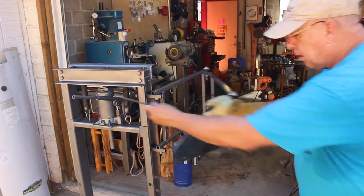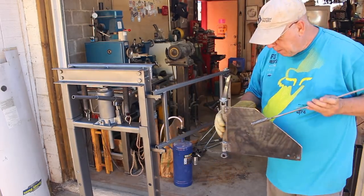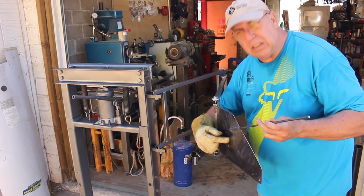Here's my torch holding device and I've got my stylus that will be bent into the appropriate place once I get the pattern holder installed and the torch head bolted on. We've got a good range of motion going on here — it's a little stiff here and there but I think it'll wear in, and I'll put some lube on it. Next step is the pattern holder — I've already tested the torch and it bolts up to the u-bolts just fine. I've got some half-inch square tubing here and I'm going to weld it into a V-shape, then bend the arms at a right angle so they slide into an area where there are a couple of bolts. They'll just wedge in — don't forget this is still my hydraulic press, so I've got to be able to take all this off when I want to actually use it.